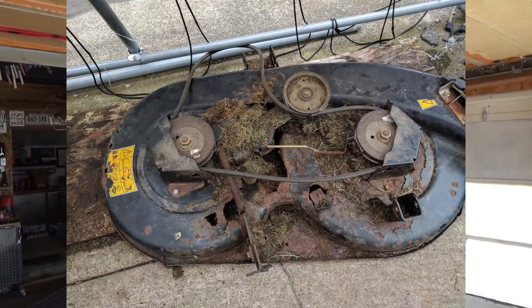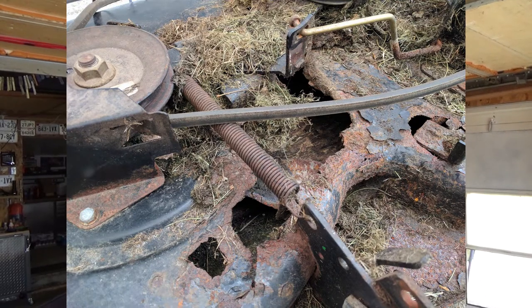Last but not least, we can have a look at this mower deck. This deck has been left to sit with grass clippings on top of it, most likely for a period of one or two years, and you can see the deck is just completely gone due to rot. Grass, dirt, and basic lawn trimmings left to sit will hold and retain moisture on top of that deck, and this will completely rot your deck out and you'll need to replace the entire deck. For this particular job we ended up finding a replacement deck for our customer and were able to swap out a couple of spindles and pulleys and replace this deck for a cost of $200, which included the labor.